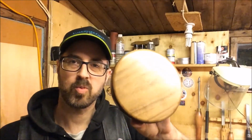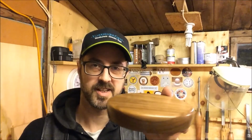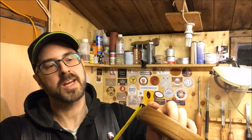This is made out of walnut, very simple shape, but then what you're actually doing is showing off what's on top of it, not this. So this is not really meant to grab the attention. Well, that's the idea anyway. So it's about 6 inches across, and it is 1 1/8 thick. And I've used Yorkshire Grit, Hampshire Sheen Original, and then Chestnut Microcrystalline Wax over the top. There we go.